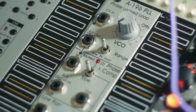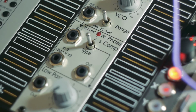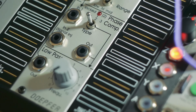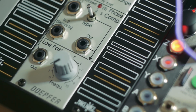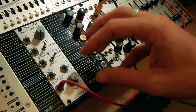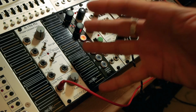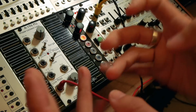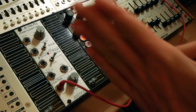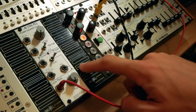So, for example, if you want another oscillator because you want some interesting extra stuff, maybe a wave folder, maybe another VCO, consider getting a PLL because it's a pretty cheap module and it basically does give you another oscillator that can track 1 volt per octave. But as you're going to see, the PLL is beset by all its own weird little idiosyncrasies and oddness. I can tell you it does give you this awesome strange, wonky, gribbly, weird, portamento-y, squeaky synth thing. Plus there are some nice applications with frequency multiplication that we're going to look at.